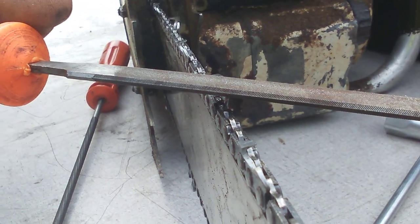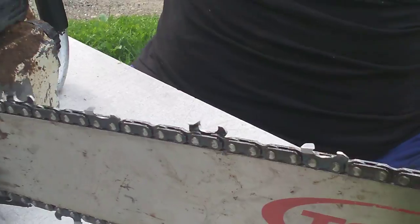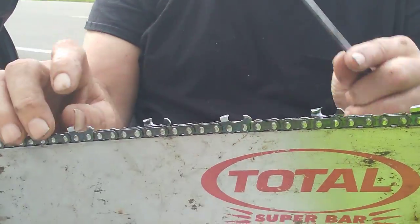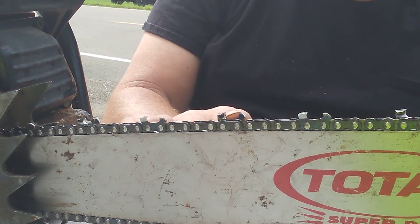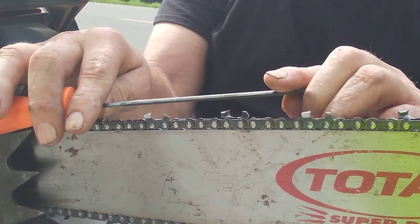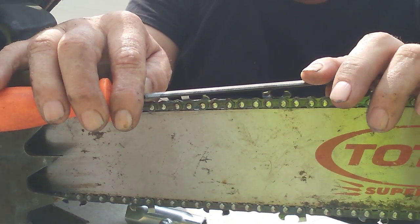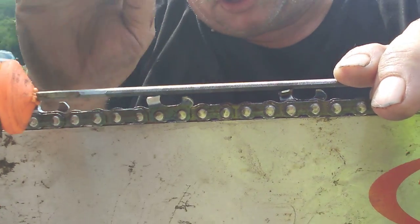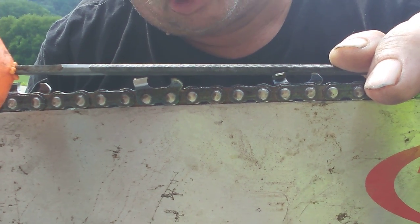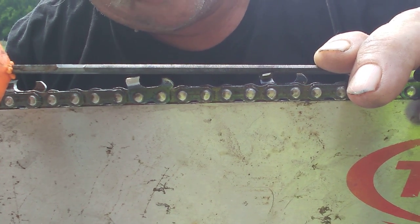It's not about strokes — it's about the distance. Here's how in the woods where you have no grinder you measure: you go from this point to this point to know what that depth gauge is. You do that with your raker file. Get right up underneath there so you can see the depth of that — that tells you where you're at.